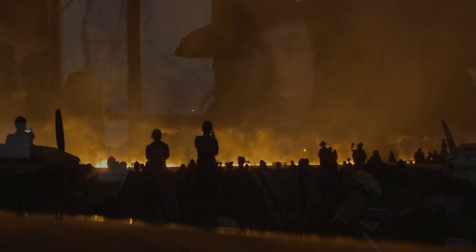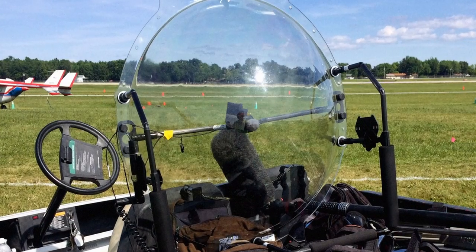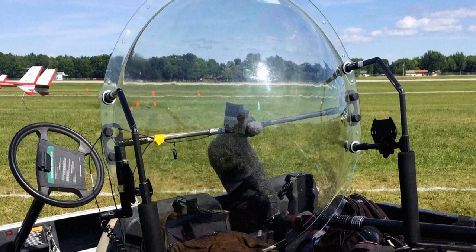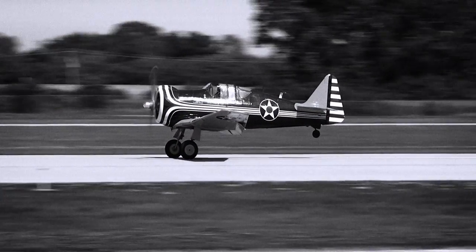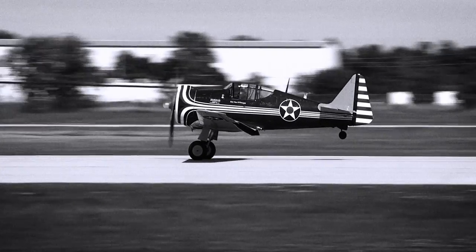Of course, I had to kick it up just one more notch. What I did was a sort of pseudo-MS recording. Instead of just using a single lav mic mounted in the center of the dish, I also added a second mic — an old ECM-55. It's not really the most popular mic to use out there because it's so big, but it's a really great sounding mic, and for this application it was perfect because it has plenty of low-end pickup. So I had this kind of pseudo-stereo MS setup going on, and I ran the mixer in MS mode. The end results were — yeah, it wasn't technically correct — but it came out sounding with a nice stereo image anyway.